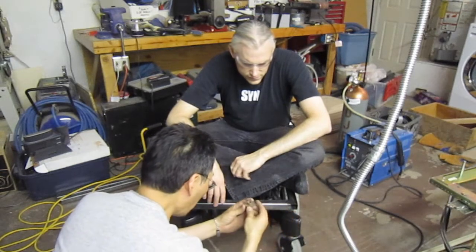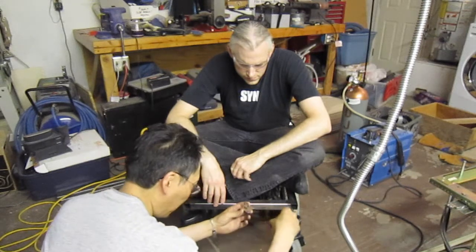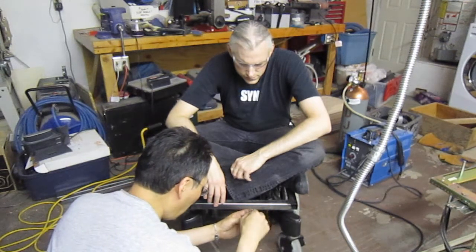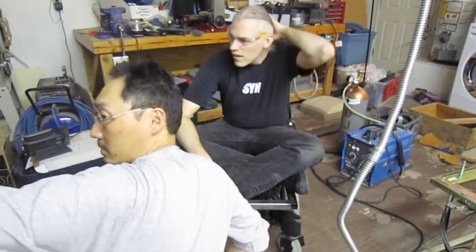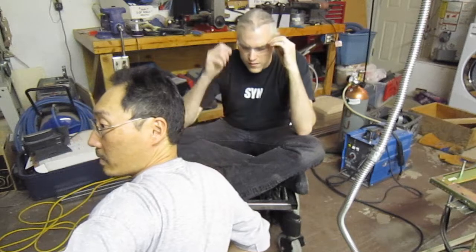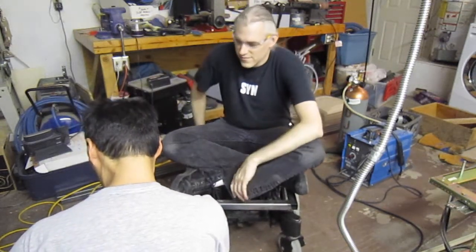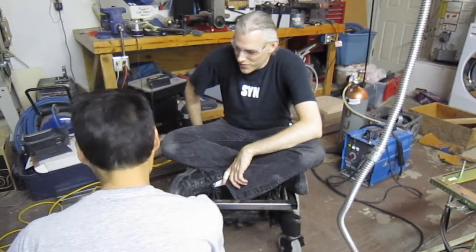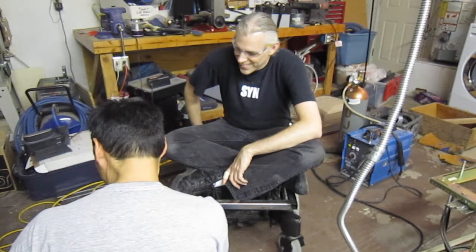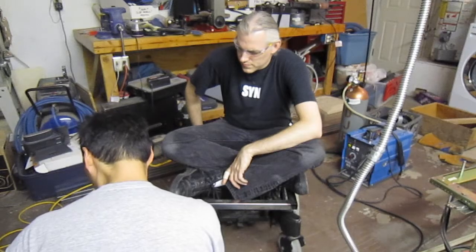So when you're welding them, it might actually be better to drill out a couple holes on a strip, and then go ahead and put a C clamp on it, if you've got an old one you don't care about. My C clamps are cheap ones, because I use them for welding, so it doesn't matter if you burn them.